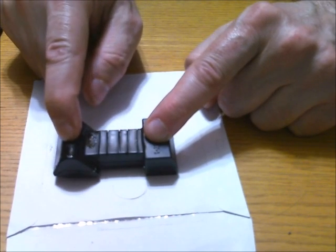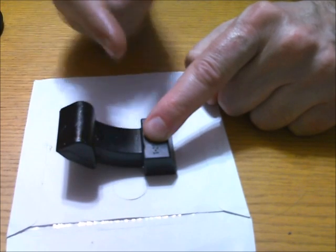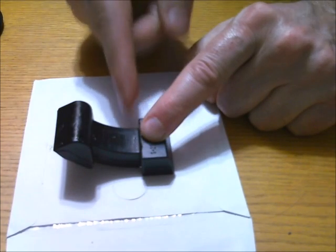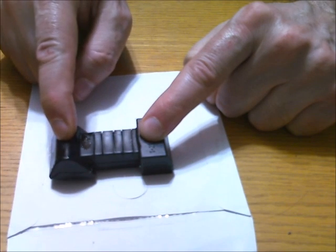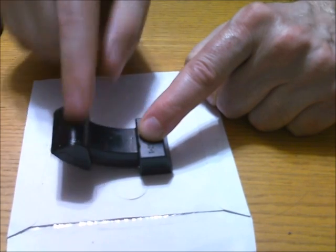The reason for doing five, six, or seven of these cuts is you don't want all the stress going on one or two cuts, because what will happen is that cut may get deeper and deeper every time you bend it and work itself right through the rubber. By doing six or seven cuts, you distribute that tension throughout all of them and they won't get any deeper.